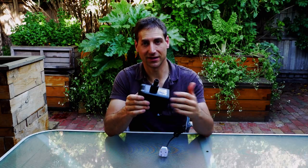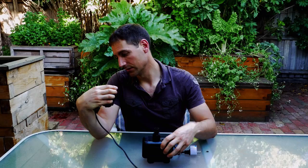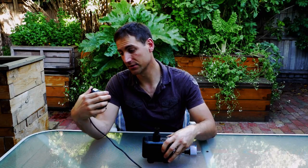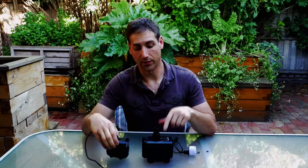These types of pumps at 1,400 liters are particularly well adapted to backyard aquaponics, such as the 1,000 liter setup I have behind me. Now we have different types of pumps. This one is quite large but we have smaller ones too. This smaller one is 1,000 liters per hour. Also what you can read on the pump is the power consumption — this one is 20 watts and this one is 18.5 watts. So this larger one is already more efficient and it's moving more water.